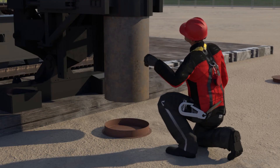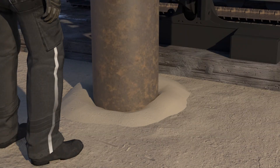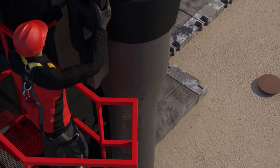The separate foot is placed on a pile position marker. Then the driving tube is positioned on the foot and the tube is driven into the ground. Once the driven tube has reached the desired depth, it is disconnected from the hammer.